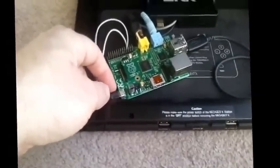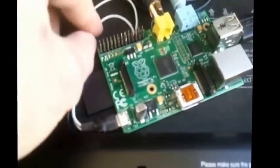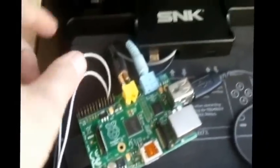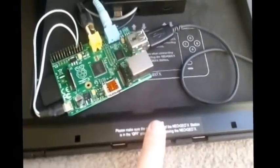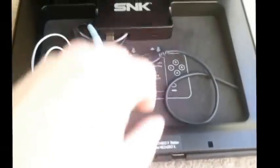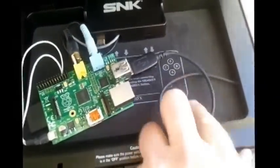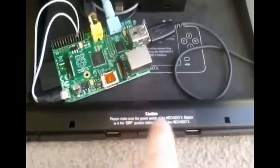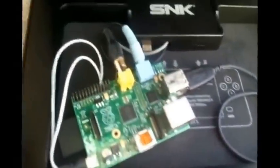I just ran the power and ground to this — these two wires here — so these are connecting directly to the power that comes in through the back, from the switch. In order to use the USB ports, all I did was take an old keyboard, cut the USB cable off of it, and soldered the four wires from the USB cable to the USB hub where the micro USB cable would normally connect, basically turning it from a micro USB into a regular USB.